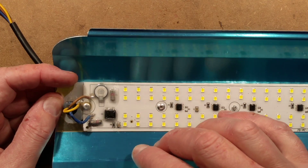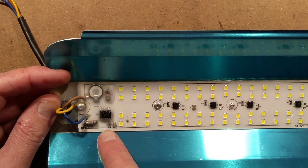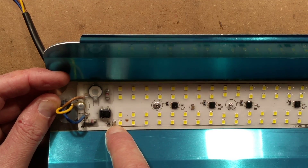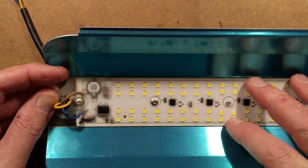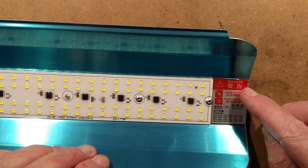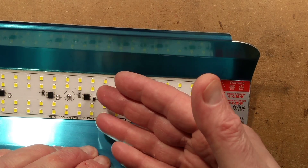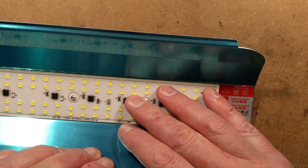They've got a couple of resistors here, presumably acting as fuses — they're 2.2 ohm. There's a bridge rectifier, a 470k resistor, and a little capacitor here — 10 nanofarad I think it was. And then a large series array of LEDs. At the other end there's an interesting label. It says 'Warning, Danger Electricity,' and that possibly is a good thing to worry about because this is just a silicon gel covering over this — you could probably touch live contacts in this.